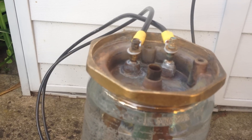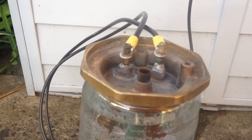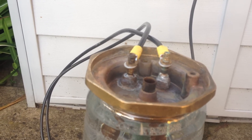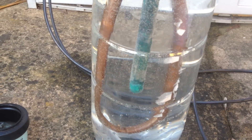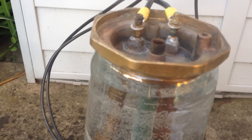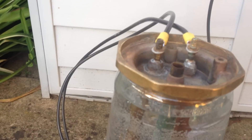Prior to that, you can put one stud on it. The studs are 13-amp socket front screws — long ones — drilled at the end to 2mm, put in the vise and crimped really well. Keep a good pull, make sure it doesn't come off. Then slide all your beads on. You've got to work your resistance of your wire to the length of the copper tube — which is not idiot-proof, but it can be done. Then you crimp the other end on, so you've now got a long straight tube with two crimp threads on each end.